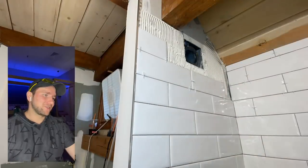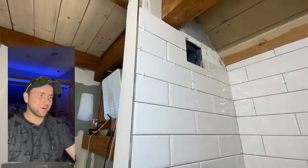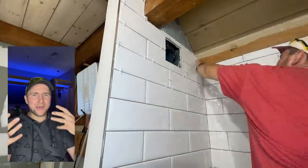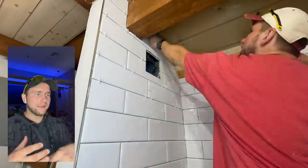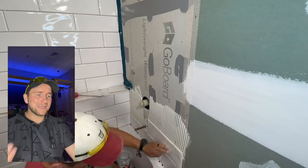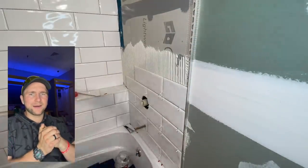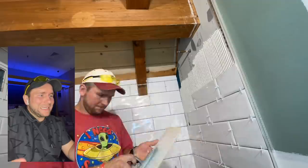What I'm always going to do is spend around 45 minutes just grabbing a piece of tile before any thinset and putting it on the wall to trace it out — see how it looks. You have to envision it installed before you start putting tile in. There's never a universal 'start here' — you just have to put it on there and see what looks best. For corners I use my Schluter strip. I'm not a huge fan of pencil edges or bullnose — I think the Schluter strip just looks so clean and modern.